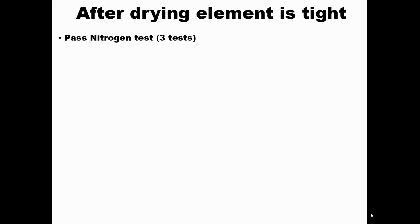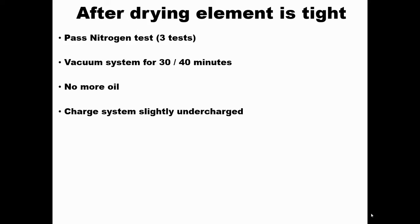After the drying element is installed, you have one choice: use nitrogen — not shop air. This is the time to be professional and use nitrogen. Then you're going to pull a vacuum — that's an important step. After that, charge the system. We're going to intentionally undercharge it. More refrigerant is not better — adding more will actually make it hotter. Adding a little less makes it colder. I'll explain this fully during principles of refrigeration.